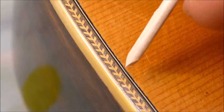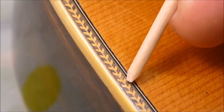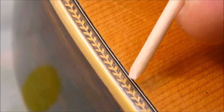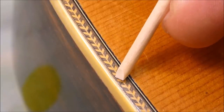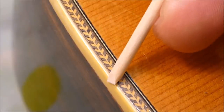In decent lighting and with some magnification, we can see how this is made up. The inner lines — this black-white-black — is probably a piece of plastic or fiber; those are quite thin lines. Inside that is a dyed piece of veneer, then we have the first element of the herringbone. There's a very thin white strip of veneer in between that and the second strip, and then another dyed piece of veneer before we get to the binding.